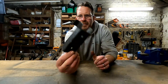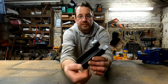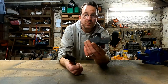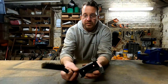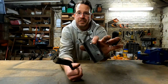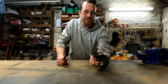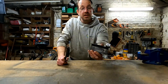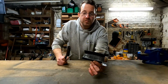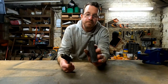There it is after about three and a half to four hours in the solution. I've just scrubbed it up a bit with a wire brush — could do with a bit more of a scrub — but this black residue is all that's left. It's a perfectly workable bit of metal and all the rust is gone. I only have five more of these to do. I need to get a bigger container to do more than one at once, but it's a worthwhile experiment and I've been able to leave it without any manual labour apart from a bit of wire brushing.